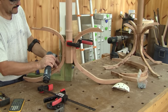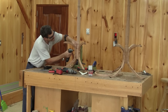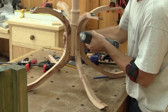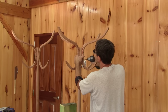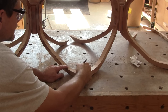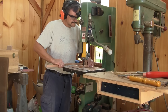Now I can screw on the legs. To screw them straight, I screw the first one, clamp the post on two L brackets, and screw in the legs. I also have to take care of the hooks on my new post. With all the legs and hooks in place, I can mark their final length, unscrew them, and cut them.